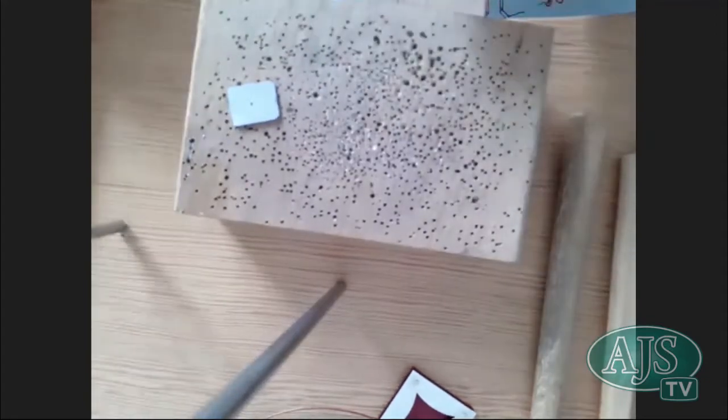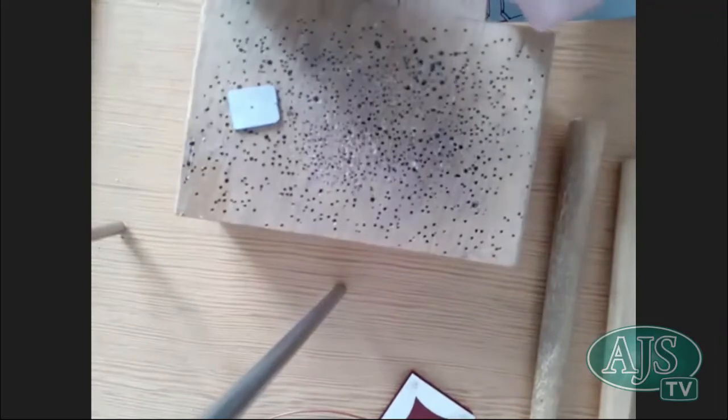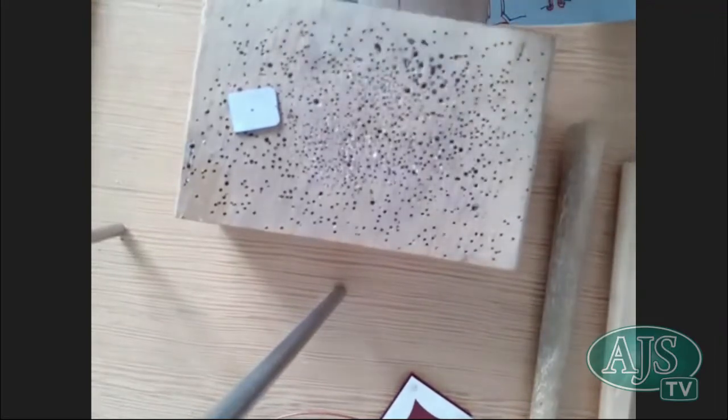Now, sometimes with softer materials like aluminium, the burrs can actually go back into the hole. So sometimes I find that just giving it another quick little drill through might be all it needs to get rid of that last little bit. So get that out of the road.